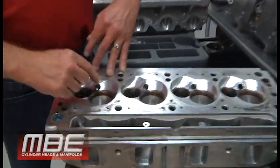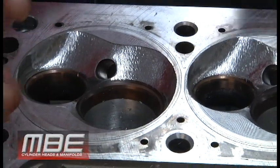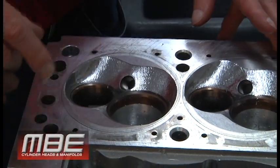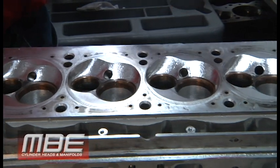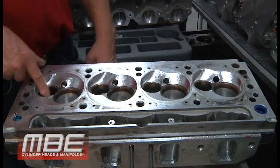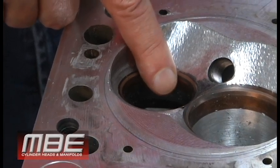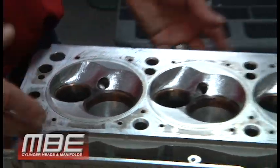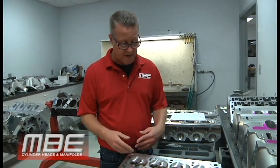This chamber was about here last time, so all that has been laid back. This would even help if it was normally aspirated, not only for the power adder. So all the mid-lift numbers are going to go up — it'll be a very big increase, and we'll show that on a video when we do this later on. We opened the throats up, and the throats are about 75 thousandths larger on the exhaust side. So the engine's going to think it's got a 75-thousandths larger exhaust valve in it. That responds to everything — NA, but especially in a power adder application.